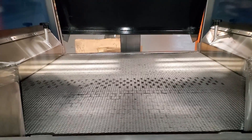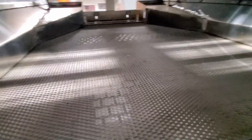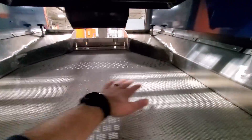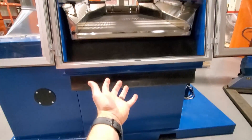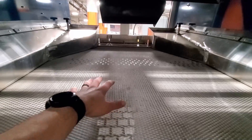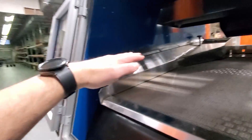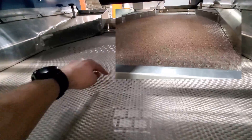So this deck here — we're going to go to the back side. The way this works is, you can see the hole in the front when I move side to side. Normally that door is closed, and then this whole surface is under pressure. The air blowing from below causes this portion to be under pressure, and that pressure transfers up to this deck. It's about 400 micron mesh, so nothing can fall through but air can come through. This deck, which is adjustable up and down, moves up and then down — really, really fast — making the material jump up the screen.